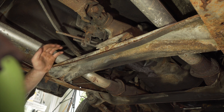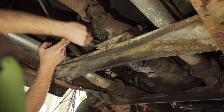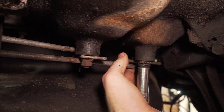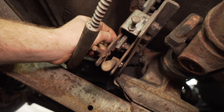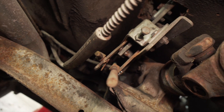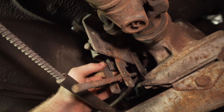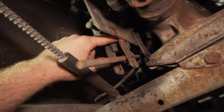They're not really cotter pins — just bent pieces of metal. You want to set it in the middle of that movement. One of these brackets is super loose so I'll tighten that up. Now it goes back and forth — this pin right here is the only issue left. I'm either going to have to pull it out, re-weld it, build it back up and sand it down, or just buy a new pin. I'm going to pull the whole assembly off, pull the pin out, look up the part. If it's not available locally, I'll get my TIG welder out, build the metal back up, and grind it back down.